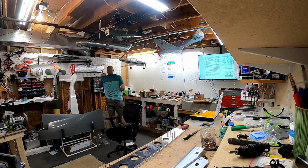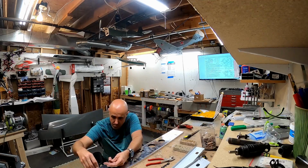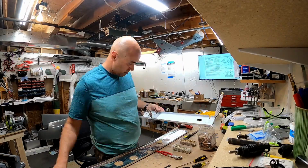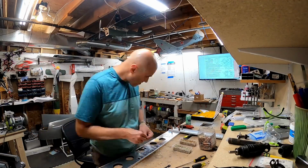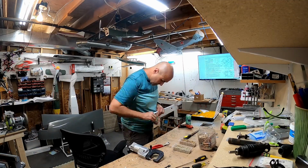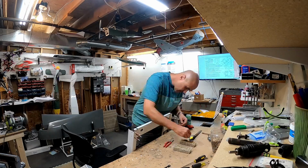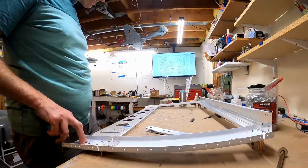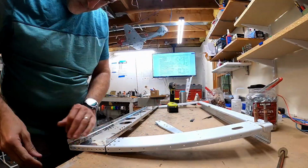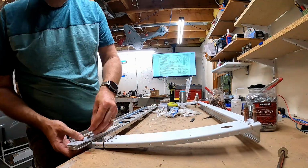The concerning part I had about this rear bulkhead that I'm working on now is that everything to the wing attach, the wing rear spar brackets, was sort of match reamed in place once it was assembled. And so I was very concerned about the sizing and the hole spacing for those AN6 bolts that go through there. I think they're AN6. They might be AN5. In any case, they're kind of big. So what I ended up doing was drilling or reaming them a little bit undersized, and then attaching the wing attach bracket there.